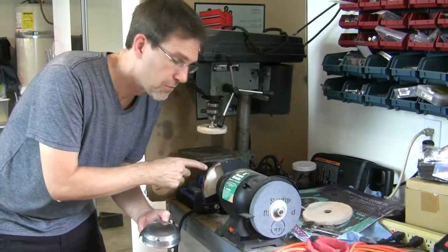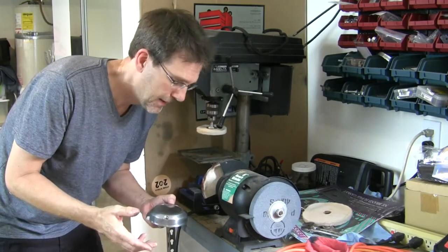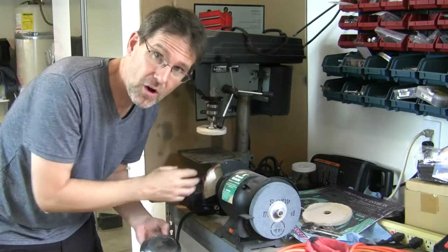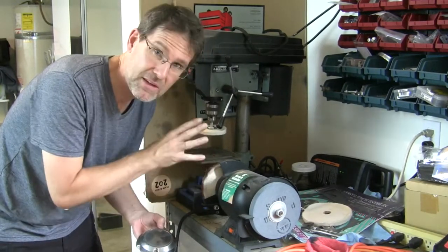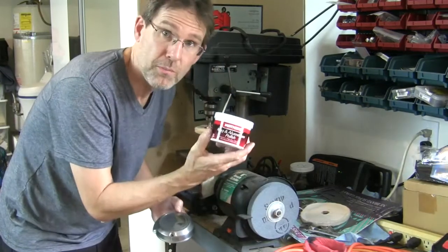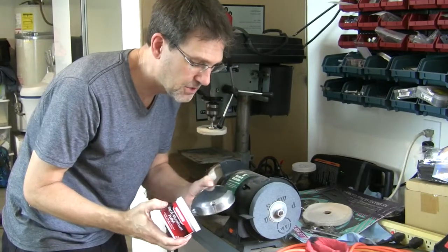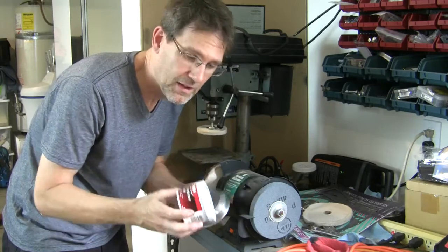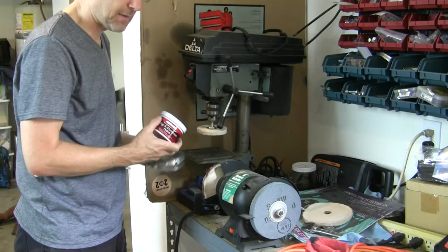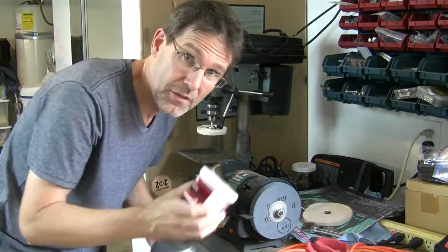So I've been working with this a little bit, and my brown compound is very dry — I probably just need fresh stuff. It's not working well; it's flinging off of the buffing wheel, and I am giving up on this. But what I tried was some of this mag and aluminum polish from Mothers, and that's actually giving a nice result. I was just doing it by hand. I'm going to move to this buffing wheel with this stuff on it and try to do it a bit more automatically.